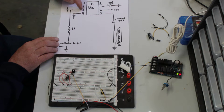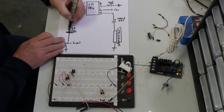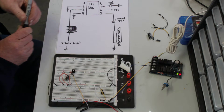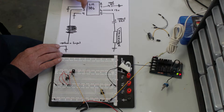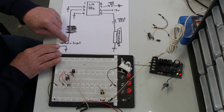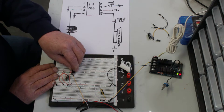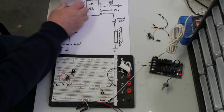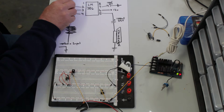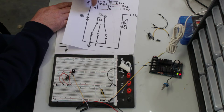I'm not going to put in the 1K resistor here — I'm finding that it really cuts down the audio quality. Pin 3 of the LM386 goes to the audio input, which is the output from the UM-3561A, which is pin 3 of that chip. That's actually the output of the siren chip.